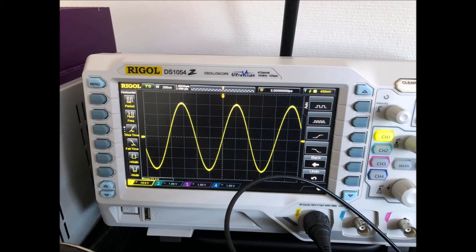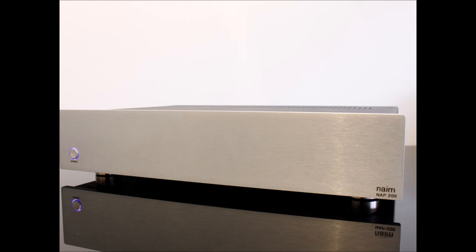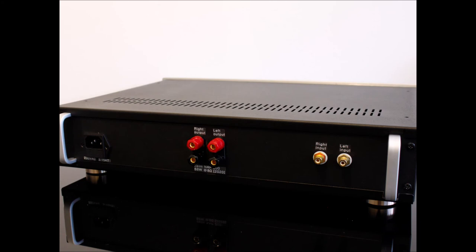There is not really a strong consensus about the bias. However, most sources mention 5 millivolts, and I think that's about right. You could up it a little bit more if you want, but it's not necessary. The original delivers about 70 watts per channel into an 8 ohm load. Mine comes very close to that, at 68 watts. The clone is very stable into any load. It can even drive a 2 ohm load for long periods of time without any oscillations and even shows excellent square wave response.